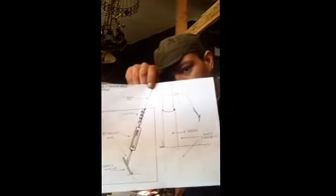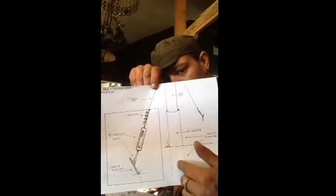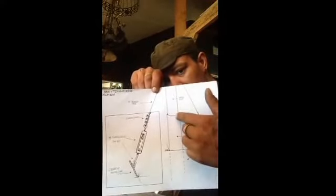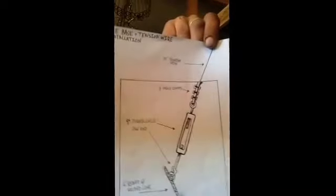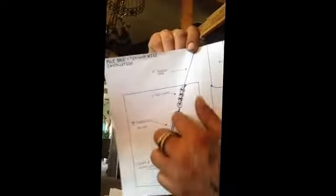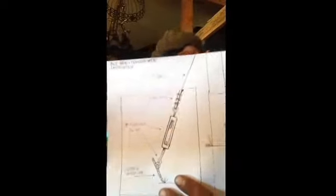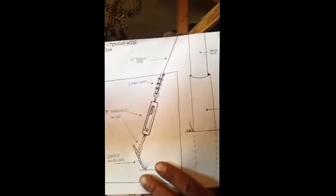At the base: bang the two-and-a-half-inch steel pipe three feet into the ground, slide the other pole in, attach your 6-foot rebar with welded link, and attach the jaw end of the turnbuckle — make sure it's fully open, meaning unscrewed all the way. Attach your clamps, then adjust and tighten everything so you don't have a big sag in the middle of your line.